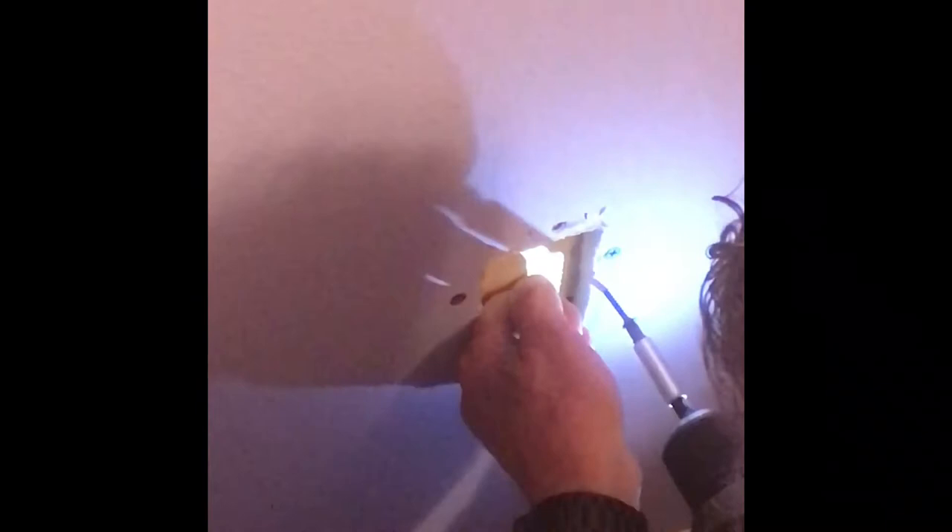I've got probably about a quarter inch of wood now because I used eighth-inch plywood pieces and stacked them together. So I've got about a quarter inch thick, and then that sheetrock screw just goes in there. Because I can't run too long a screw — it'll hit the block wall — I had to use one-inch screws, and that sheetrock is half inch. So it goes all the way through the wood, but there's probably about a quarter inch on the backside. There's just not a lot of space between the foundation and the wood I'm putting back in there.